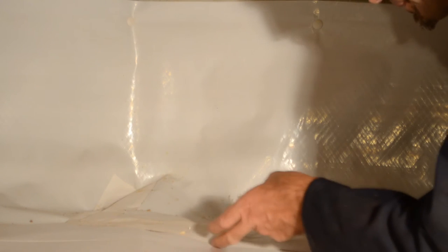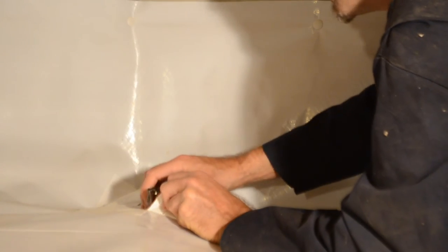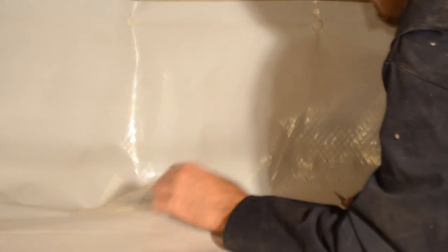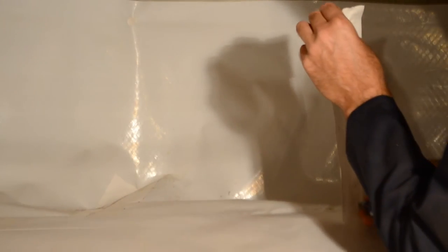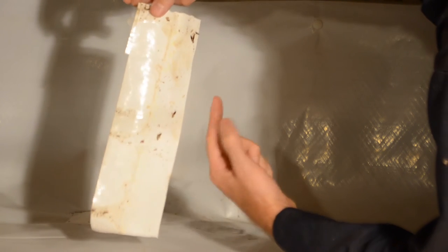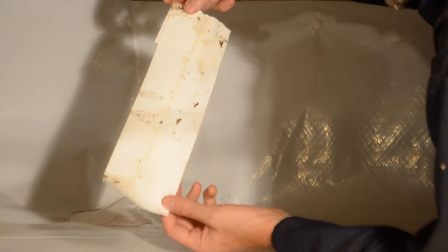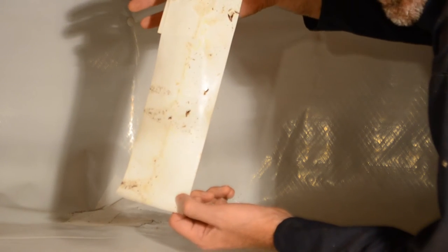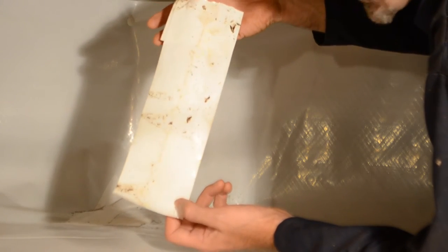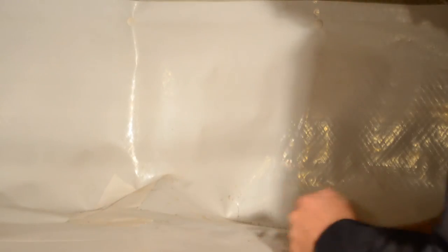This tape isn't stuck on either side, so I'm going to find an area here to tape to give you an idea of what you're looking for. Let's pull this section of tape up and see what's going on underneath - see how well it's stuck. This is a workmanship issue. I can see fingerprints all over it, I can see where water has come out in the past, and we've got bugs, sand, dirt, and debris. You can't get a good seal if your crawlspace surface is stuck with bugs.